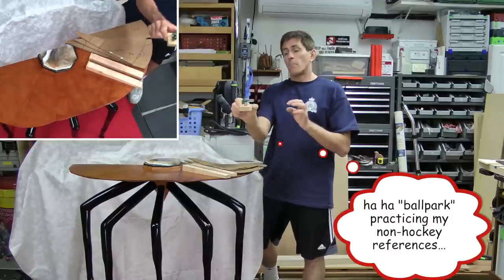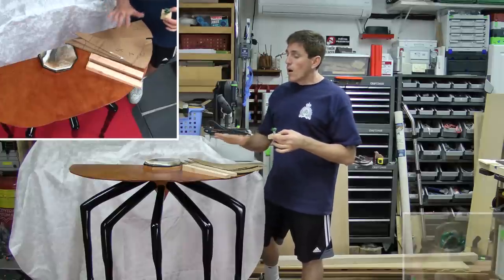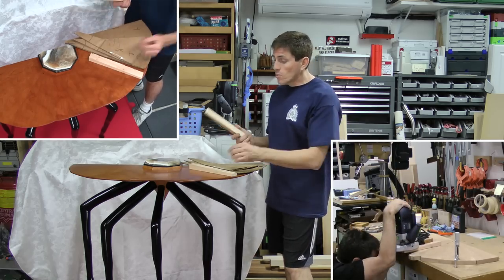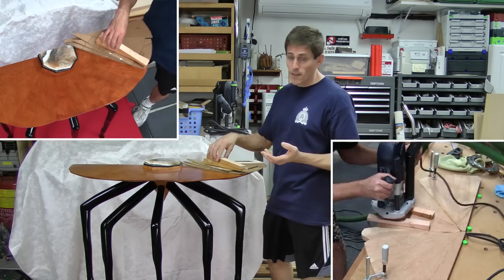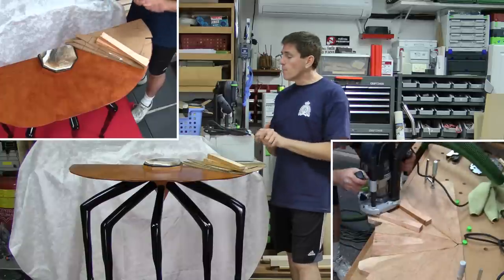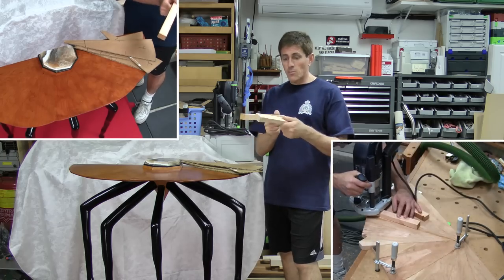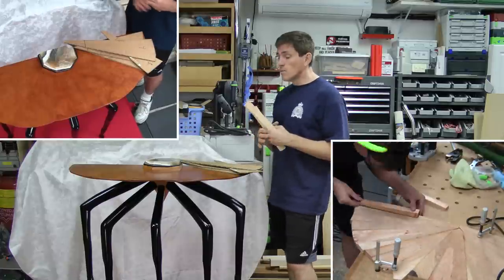The bit I used was a dish carving bit — flat on the bottom with a rounded edge going straight up, so the outside edges curve up nicely. I used double-stick turner's tape on the bottom of the ramps and stuck them to the stock at the wedge joints. The dust collection suffers greatly when the bit is projecting out far with nothing to capture the dust, which is why you saw so many chips flying off the side — though I didn't have cherry boogers in the morning, so the vac was picking up most of the fines.